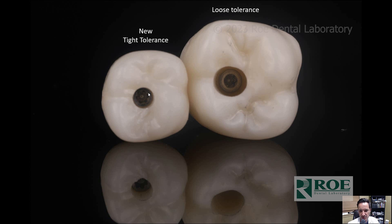So if you use this Vortex screw and you import the Vortex geometries into your Hyperdent library, every time you take a full upper arch and you import it into Hyperdent, those calculation tool paths to be able to mill it — it'll automatically recognize the screw and it already has pre-calculated tool paths. So the calculation times are going to be faster and the results of your milling are going to be tighter and better, as long as you have the template generator. And we can provide that for you if you ever need — just reach out.